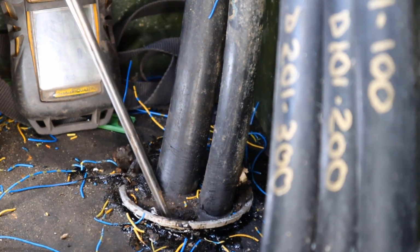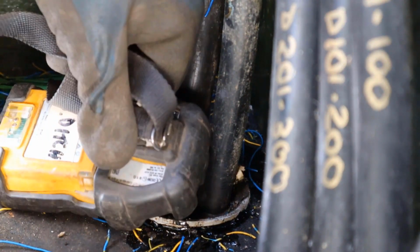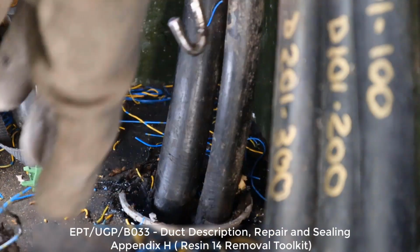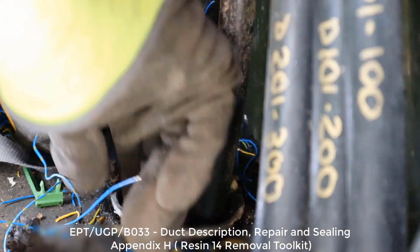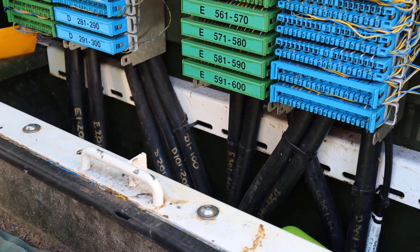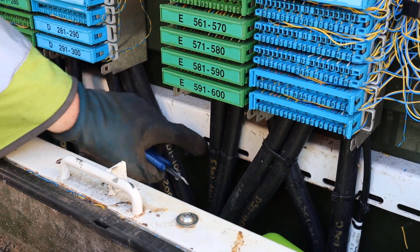Constant gas monitoring must always be adhered to as per training. Guidance to duct sealing and repair can be found in the link below. Within it is a more in-depth video. Once the duct seals are removed, we cut away the restraining cable ties and make sure the cables in the duct are able to move freely.